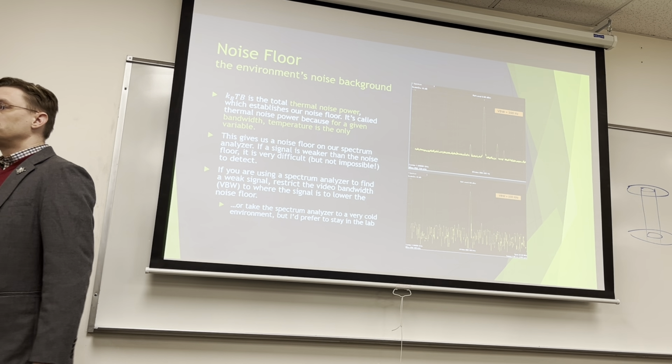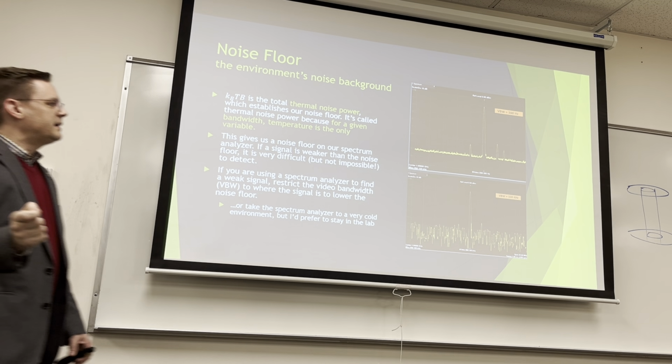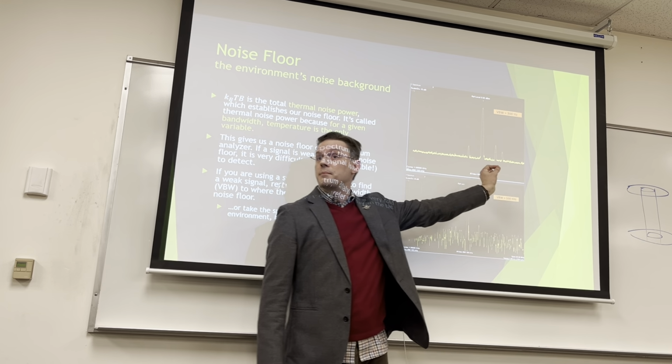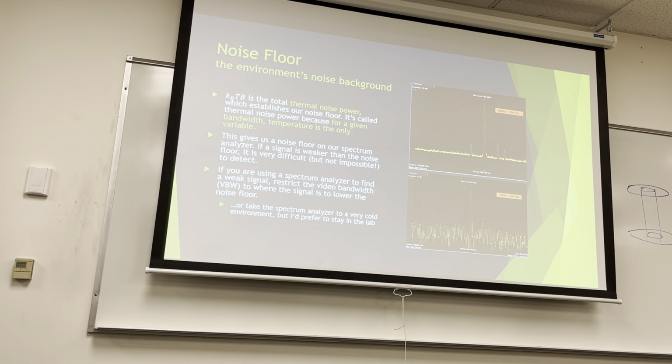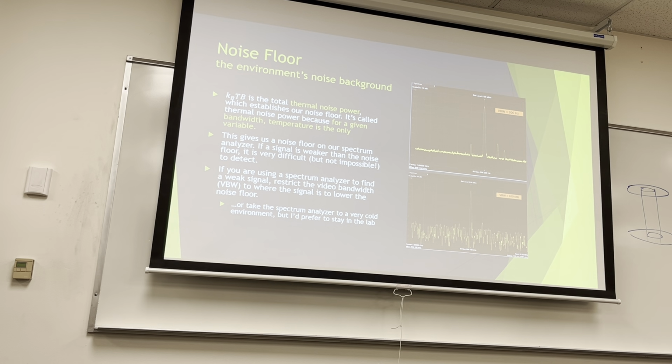I've seen the term video bandwidth and something else related before. What does that mean? There are two types of bandwidth you can set. You can set an IF bandwidth, which is how many bits it scans at a time. That's sort of like a Nyquist polling rate, how often do you sample. That's one bandwidth type. The video bandwidth is where am I starting and stopping? They call it video bandwidth because that's what's shown in the video display.